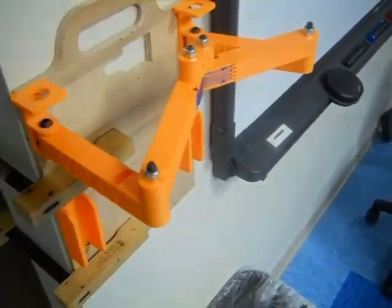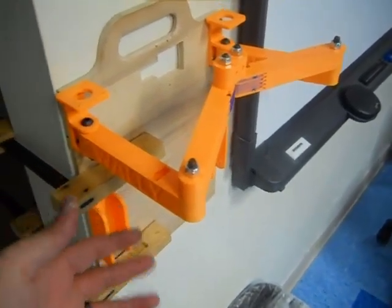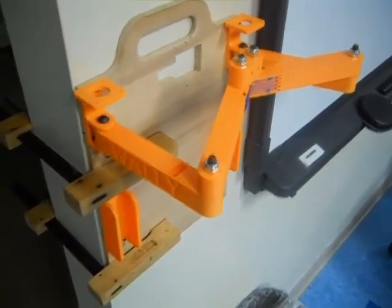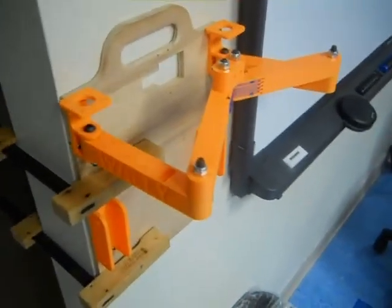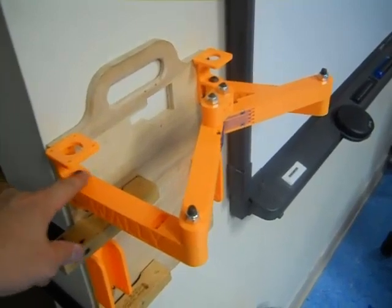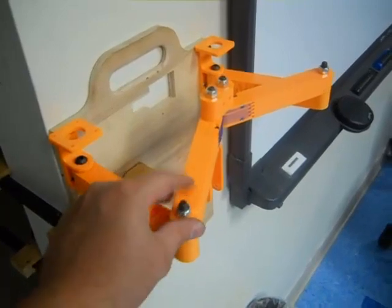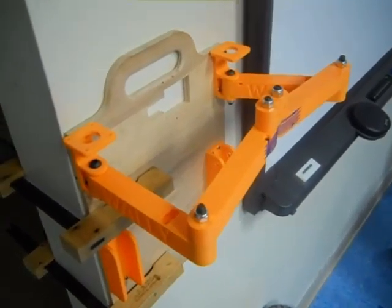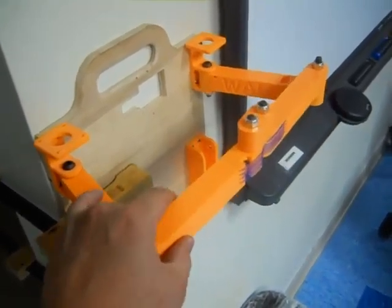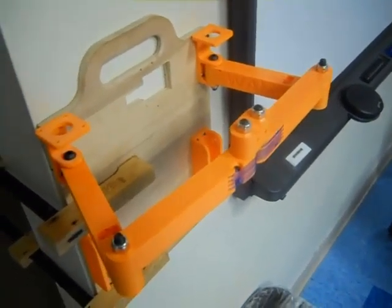You can see down here there are brackets and there will be some arms coming out of that for the Z-bed — that's going to be the basic form factor. There will be motors up here with pulleys that will drive bigger pulleys here. I'm looking at about a 7 to 1 mechanical advantage, and I'm actually driving the angle of the elbows, which is going to keep me from having singularities whenever this gets in a straight line.